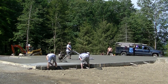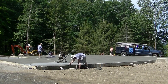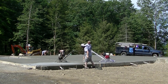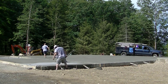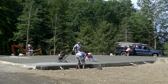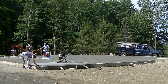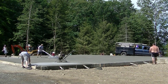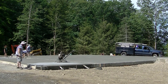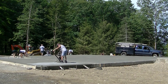Video can give you a pretty good idea but won't replace the actual experience on the concrete itself. You can see Darren tapering down that last doorway — he cuts out about a half inch of concrete and tapers it right where the garage door is going to sit, about eight or nine inches in from the board. That way when the garage door sits down and any water from rain hits the door, it'll hit that taper and run out the door rather than back under it.